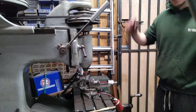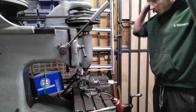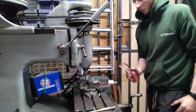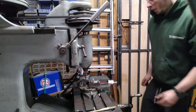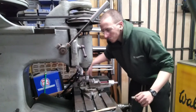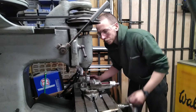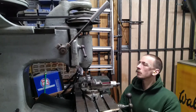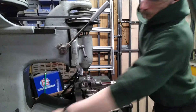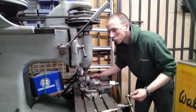Okay, here I'm just setting up the mill, using a basic half inch end mill. I'm just going to take a few passes off this ring that I've just made, just to give it a flat spot, so obviously I can put it on top of the frame - makes it easier to sort of align when I come to weld it. Could have done it with the grinder, but I figured with the mill already being set up it's just as easy to throw it in and just mill the top of it. Really simple, but I figured it might be interesting for somebody to see.